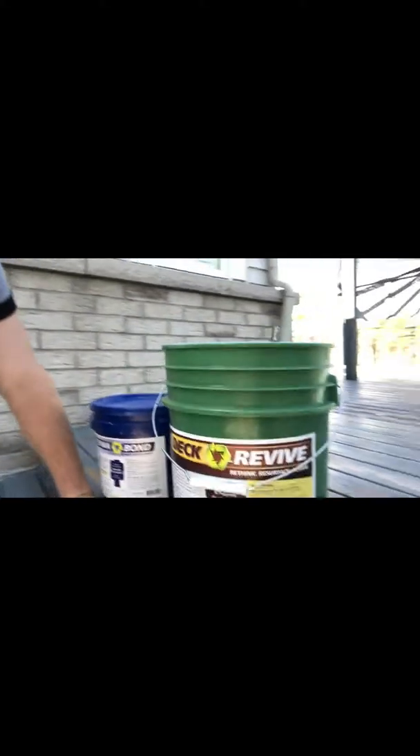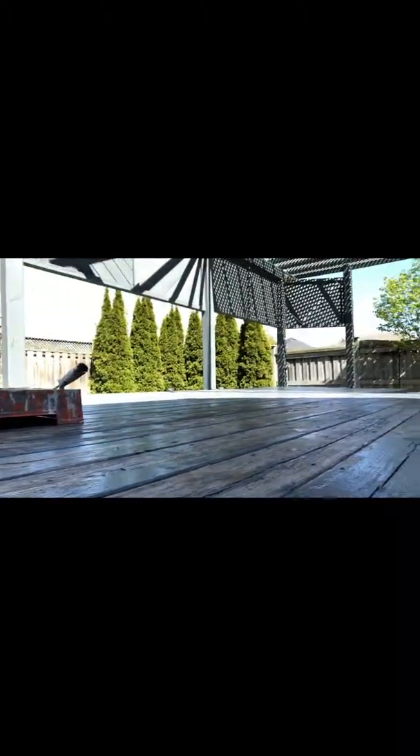Deck Revive — it's the color we've chosen, mixed with some kind of cement-like powder, and it's going to be like a firm structure. I'll show you the application around the border — I brush it along there. We're just starting with the edge and we'll work across the whole deck with a brush.